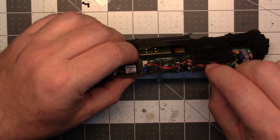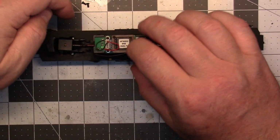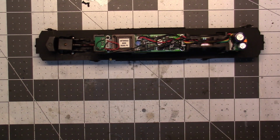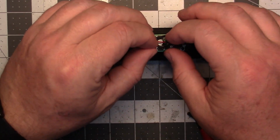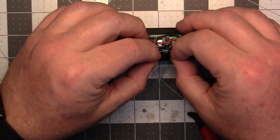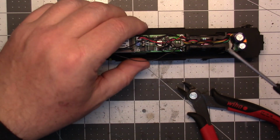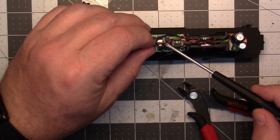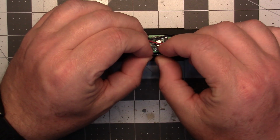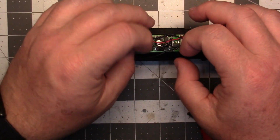So, what am I going to take out here? What am I leaving? These two black wires, track feeds. Go ahead and pull that up. Right there might be our problem, why it keeps shorting. I've got some wires melted together right here and right here. So evidently this thing has gotten hot. It looks like that one's burned into a little bit.